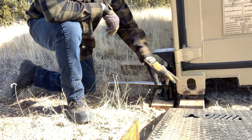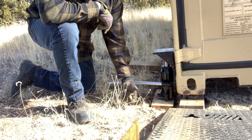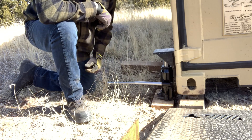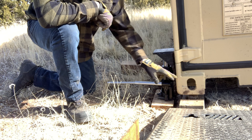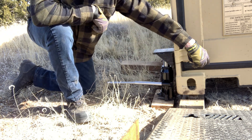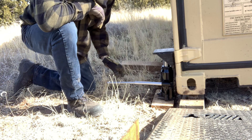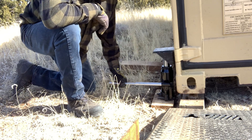You can use a farm jack — I use a farm jack on the front sometimes, or even these cups on a farm jack. Sometimes you have a hard time getting underneath containers when they're too low to the ground. Most farm jacks have about a three to four inch sweep — they're not really designed for getting off the ground, they're for lifting jeeps or pulling chains tight. I use it with a chain wrapped through and across to give me the gap I need, and then put the farm jack. I'll show another video of that.